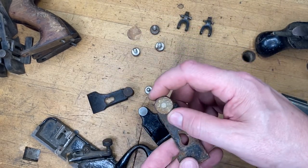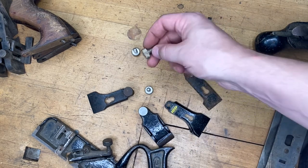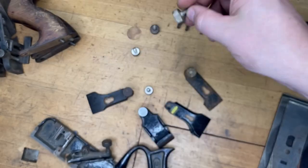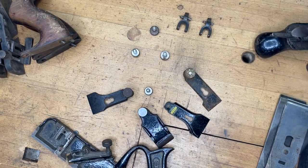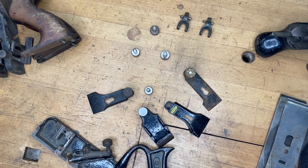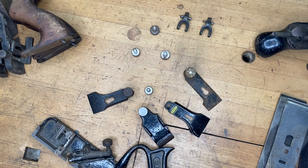Just know that the ones with logos or trademarks on them are actually for the 39s. I don't know of any other tool that used the logo or trademark on the top of the screw head itself. That screw is also found in some other scrapers such as the 81 and 82 — those will have that same thread pattern. So that's one of those suitable substitute categories where the same screw can fit across multiple planes.